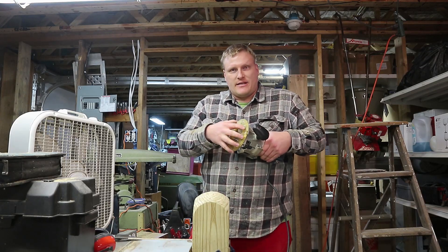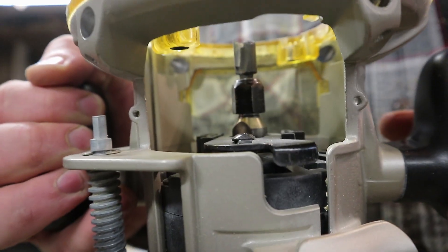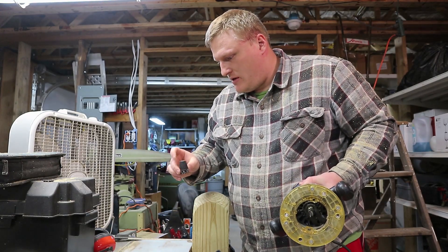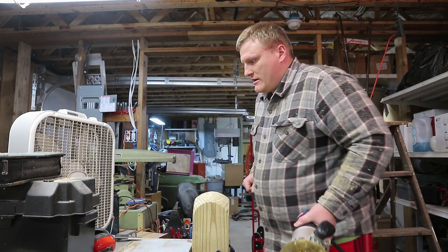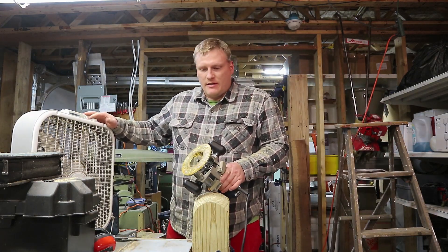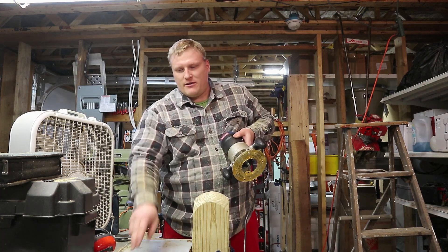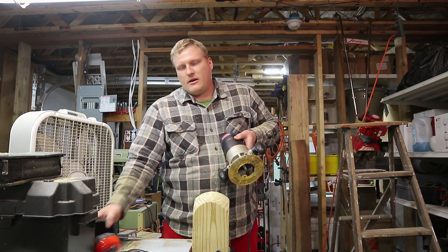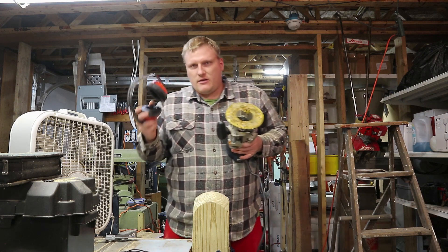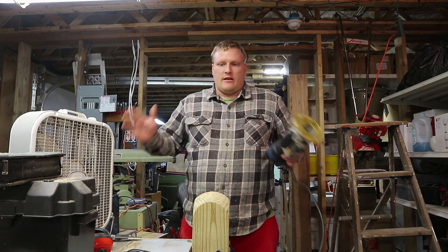When I first started, I had the base extended all the way and it was still taking a very aggressive cut. All the vibrations and movement made my adjuster wheel come off, but the screw's still in there. I set a fan up to deal with the chips, but I really had to put a guard in to keep chips from blowing at me. I got out some bigger safety glasses with better protection. You'll definitely want to use earmuffs too because this is a loud operation. Also, dust is everywhere, so do it somewhere where you don't care about dust getting everywhere.